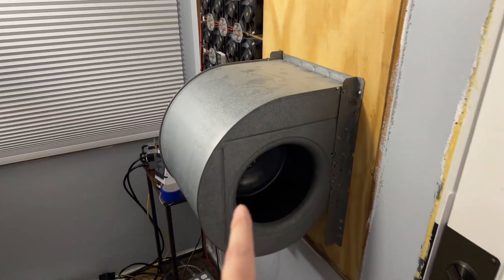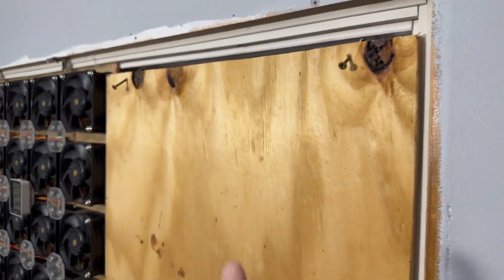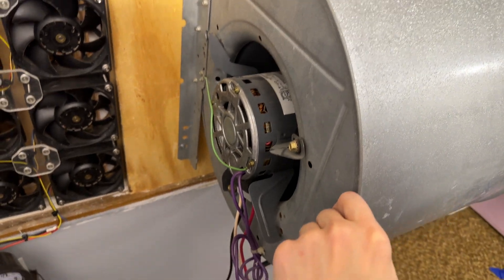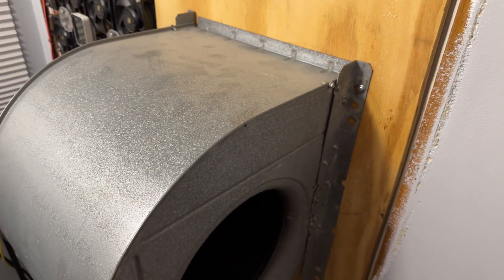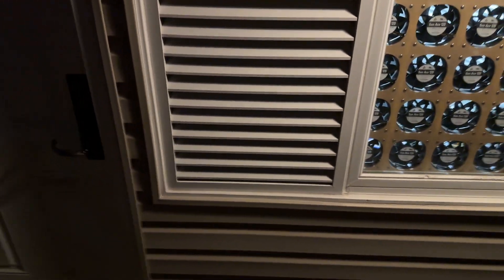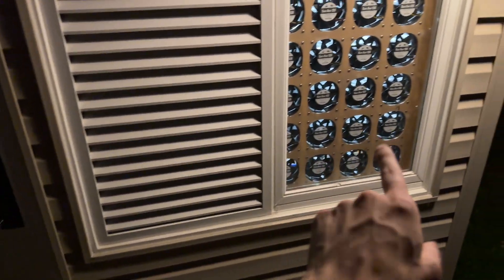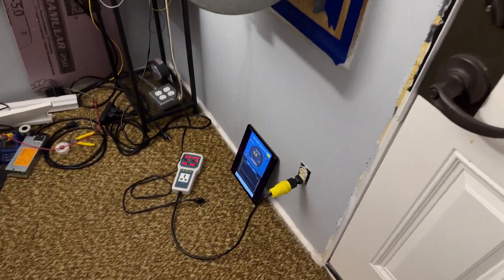It's in and it's running — not the most secure installation ever. I have some plywood jammed in with screws at an angle and some PVC. The window frame is not modified; this is all removable, no holes made, and I can put the glass back in if I wanted. It's secure enough. The hole in the plywood is slightly bigger than the outlet of the blower, so there shouldn't be too much impedance. I have to manually change the speed taps on this plug, so I'll cut between tests. It's set to the lowest speed tap right now.